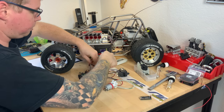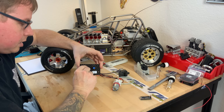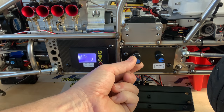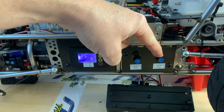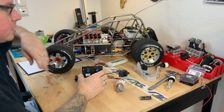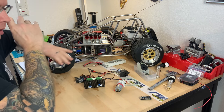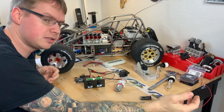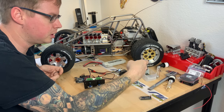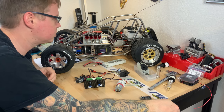You can control both pumps individually regarding their on and off switching times. There are two dial knobs and I can freely adjust when each pump runs. This will be perfect to make a balance ensuring the crank is always lubricated but there's not a lot of excess oil in the crankcase. The excessive oil that gets past the piston rings will also be caught in this tank. Over time the oil will mix up, so I'll need to do an oil change — every hour or every two hours — I just need to see how this turns out.